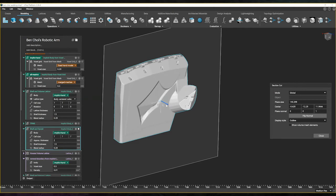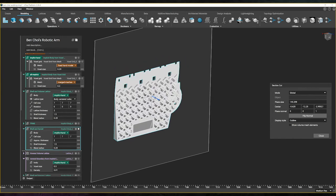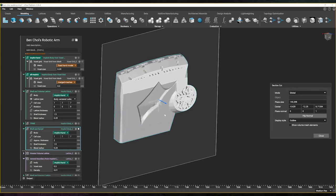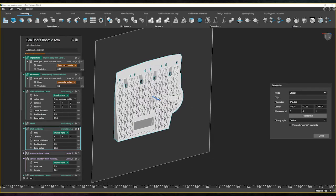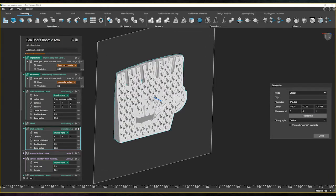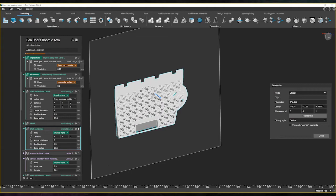So there's a liquid resin that we're solidifying, and you could actually tell that as complex as this is, and even though it kind of seems like there's all these open channels, there's actually no way out of that shell. And so even though the gyroid is co-continuous through that volume, the resin that would be left behind would be stuck in the hand. So we're going to need to create a way out. And so let's see if in just a minute or two we can create a drain hole.